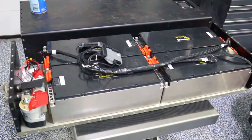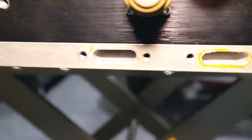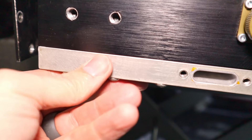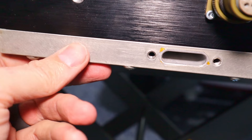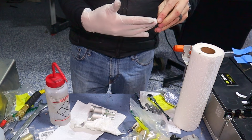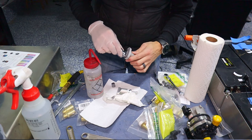Got them both. Here is the rear battery box and down here is where we've got the cooling ports. This whole bottom plate is kind of wrapped in plastic — it's not metal. But this is where the ports are. We've got to seal against this. I'm going to take those ports and do the same thing where we just make a gasket around it and cinch it up.